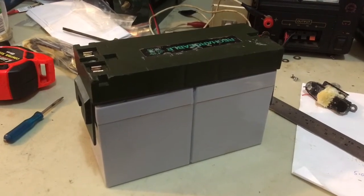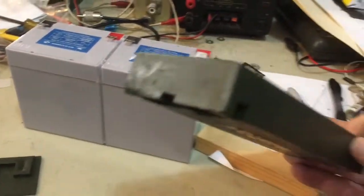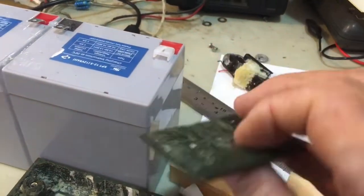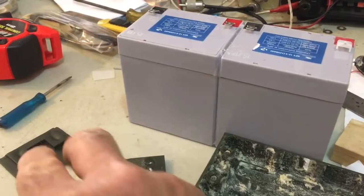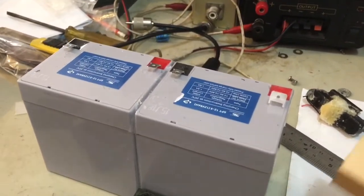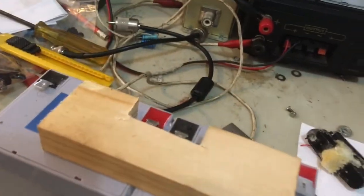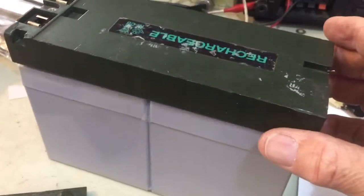For the next step I decided to go with the cut-off method. I've cut off both clip ends and the idea is to glue them back on with silastic when the battery is completed. Silastic is pretty good stuff - they use it to stick windows in spacecraft, so I reckon it'll hold fine. I've also made up a timber pack to go on here to hold the top up to the required height, and then I'll silastic the top of the box on top of that.